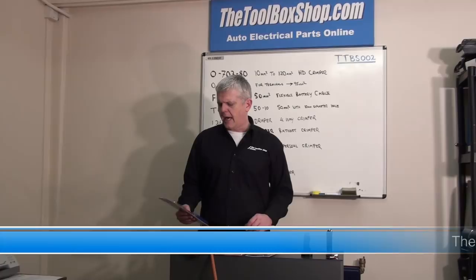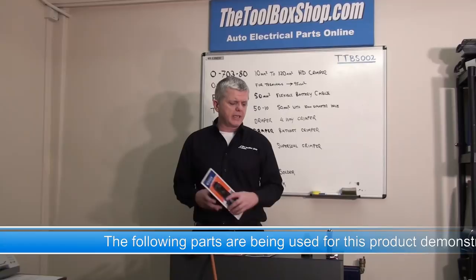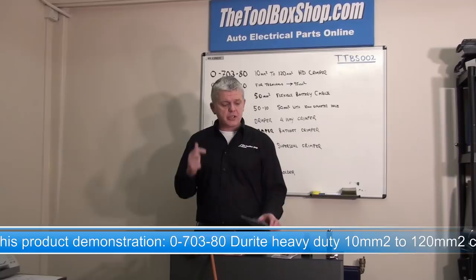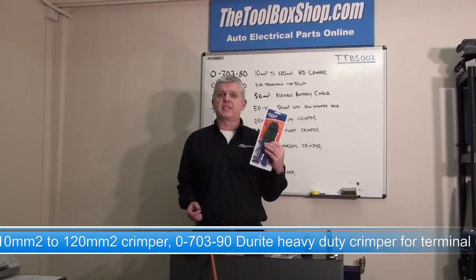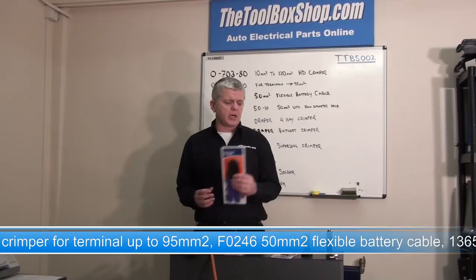This is a straightforward one so we'll start with the tools we're going to be using. The light duty terminal crimper — that's the Draper one. Many of you are familiar with it. It's the type where you affect the crimp with the force of your hand, and the force of your hand dictates where the crimp is set. The later version, the ratchet crimping tool, is becoming popular because it pre-sets where the crimp terminal should be set. So instead of relying on your own brute force, you're getting a pre-set — you ratchet crimp them up.